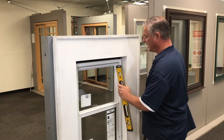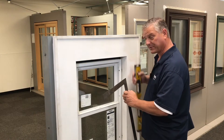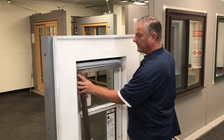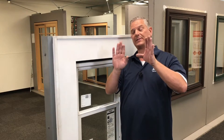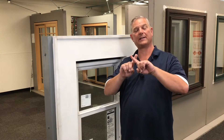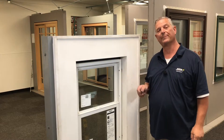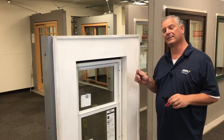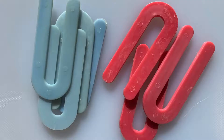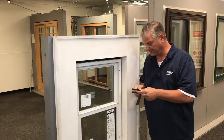Just like with any window installation, you want to make sure that everything is square, plumb, and level. You can also take a regular framing square — which I highly suggest, because some levels can be off a little bit — and check all four corners of your window. You also want to check to make sure everything is true, meaning the window is not twisted. Some people will take a string from each corner and cross-string it to make sure the string touches in the center; if there's a gap, your window is out a little bit. For shims, I recommend composite or plastic shims rather than wood, because wood can rot if moisture gets in. These break off easily and you can stack them.